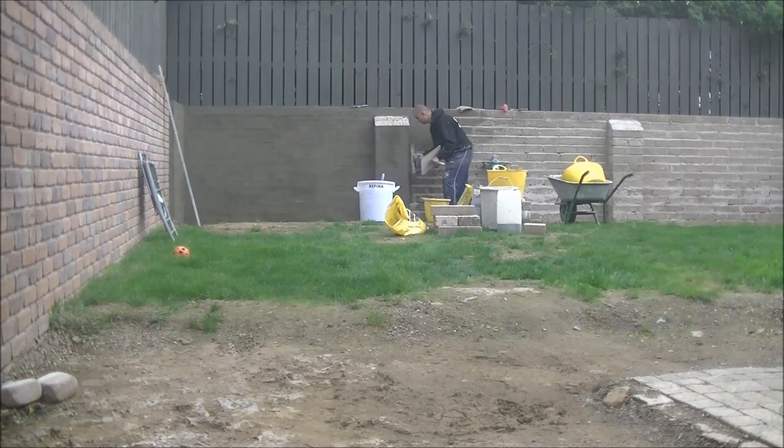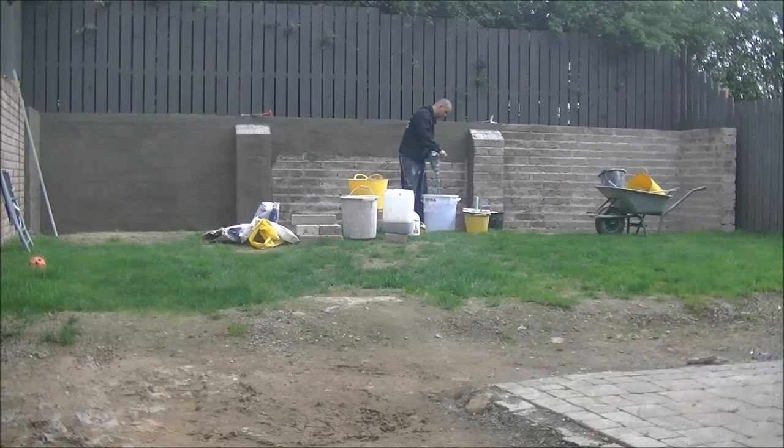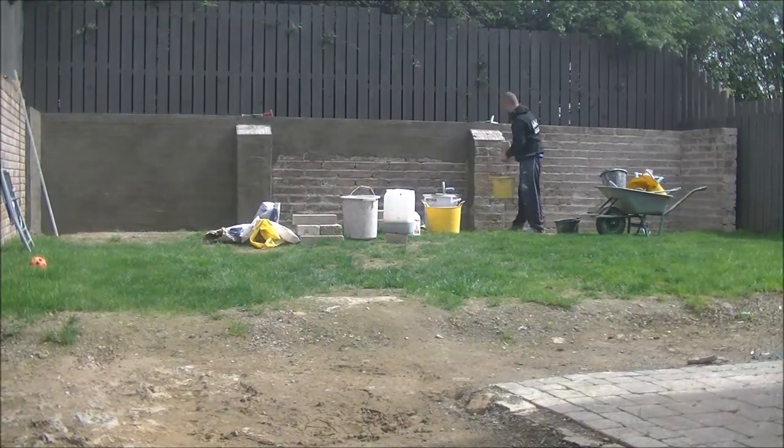And for the scratch coat, I've just used the Colo mix, and maybe been a wee bit hard on it, mixing so much cement recently, but it's been getting on well in the big massive Refina mega mixer bucket there. Just filling it up, I think it maybe took 3 of them tubs to get this all scratch coated. Not putting it on deadly thick, as there are another 2 layers to go on the next day once this sets up. Again, not a bad day for rendering.